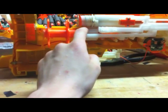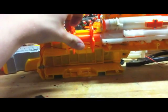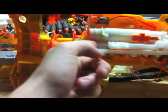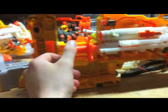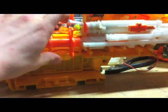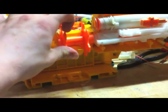This has a slip mechanism — I don't think that's the proper name for it, but essentially it means this can turn freely on a different set of teeth on the inside of these outer teeth. So that's bad, because the turret made it too heavy out here with all the leverage for this to spin. The arm would go back to push the teeth, the teeth would spin partway, but the belt would not advance and the turret would not spin because of that slip mechanism.